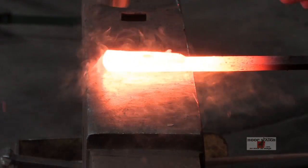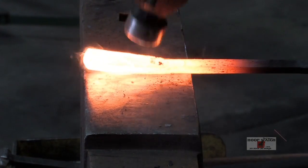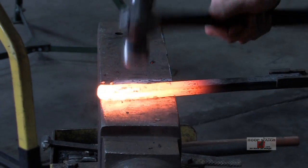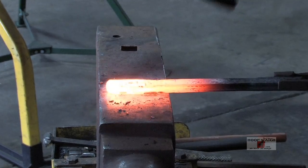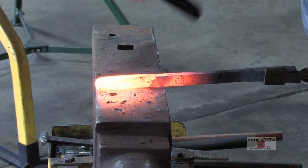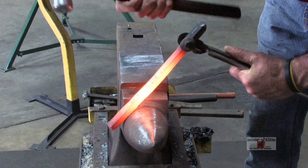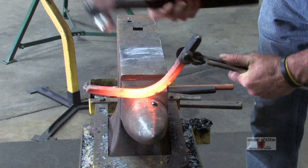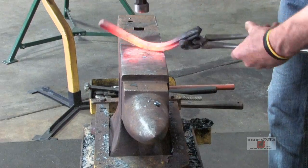We're going to start at the back and then just slowly pull your hammer towards you and then put the end in — just kind of focus on getting that in, go all the way around the side. Once it cools down a bit, you don't want to focus on that scarf because you can pop it since there's not much material there. I've got half-inch tongs which fit kind of thick, so I'm just going to make my toe bend as loose as possible, because everything is going to want to push in the toe.